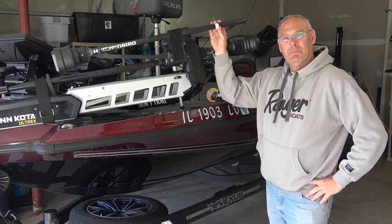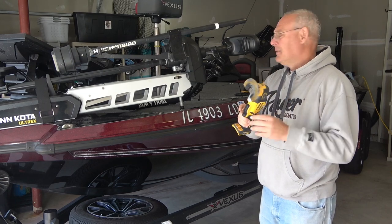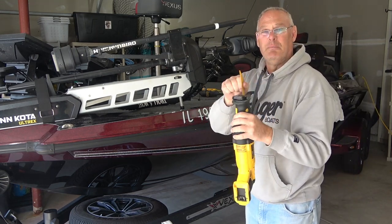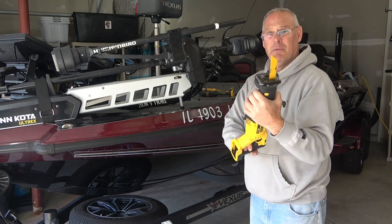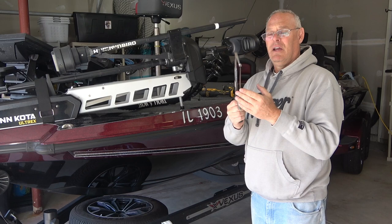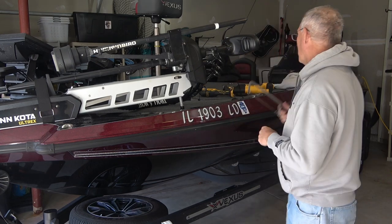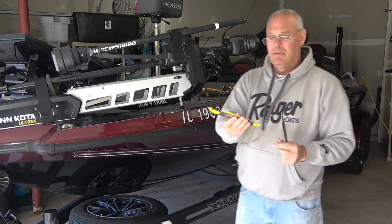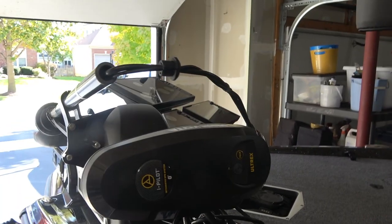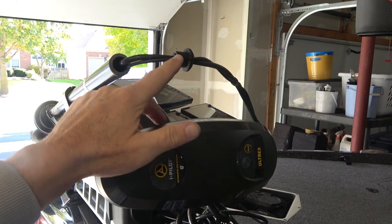To do this you'll need just a couple of tools. You could use a multi-tool with a titanium blade, but a better choice would be a sawzall with a metal blade — the shorter the better. You could do it with a hacksaw but that would take forever. You do need a hacksaw, though — I'll show you what you need it for in a second, but I'm not going to be sawing with it. You'll also need some blades and a file for the very end. The first thing you need to do is take this rubber piece out of the shaft — I just wiggled it a little bit, it came out, then slid it up the wires and out of the way.